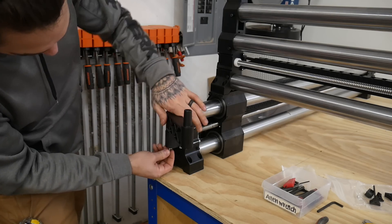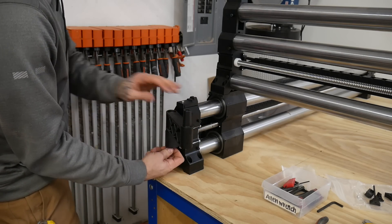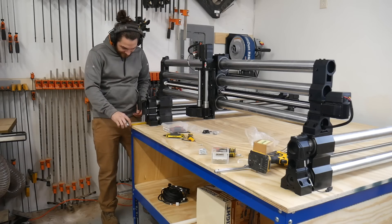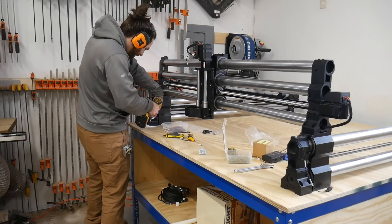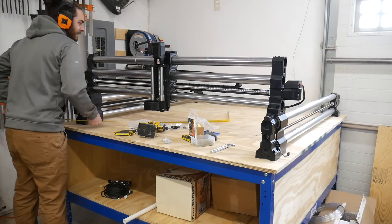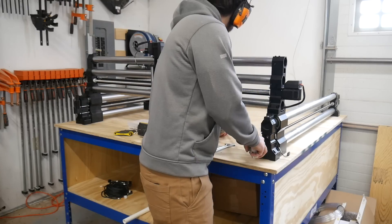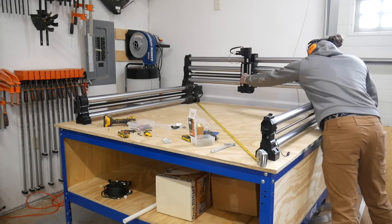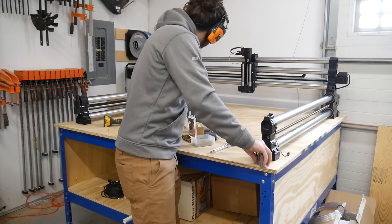Then we're going to slap the DPZ on here. I don't know exactly where it's going to go so we're just going to get it close enough for now. And then the arm for the Masso screen — this is actually aluminum. Now I'm going to use all my strength to kind of center this on the bed, then lock down one foot and work my way around the machine after I ensure everything is square and even. Once I get the two front feet locked down I'll shove the rail all the way back to ensure the back feet are properly spaced so nothing binds when it moves all the way to the back.